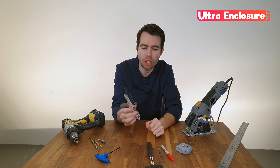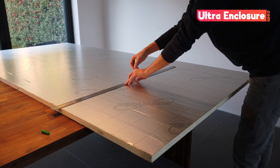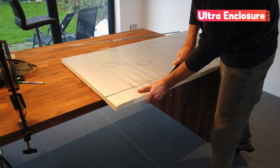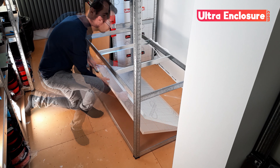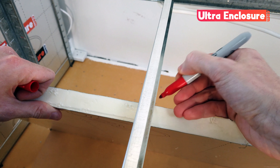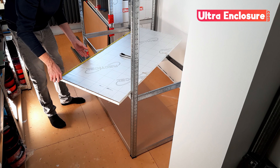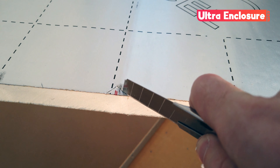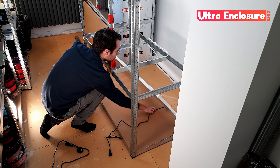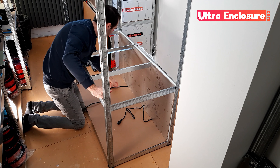For the foam I'm going to measure the width and height at the back of the first shelf. I want the foam to go all the way into the corners and from the board up to the very underside of the shelf above. Cutting this foam is pretty straightforward — measure and mark the rectangle and carefully cut along a straight edge. It should only take two or three passes to get a clean straight cut. Now take the foam and place it into the shelf at an angle. You should have a nice snug fit on the sides. As you push it up it will hit the shelf braces in the middle — mark the contact points. Now remove the foam again and cut notches for these shelf braces. At the bottom of the backboard I'm going to divide the width by four and mark this in from either end. I can now make a small notch to allow the power cables into the enclosure. We can now reinstall the foam — first place the two power cables on the shelf for your printers and guide them through the gaps, then just push the foam back up snugly into place.